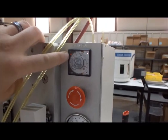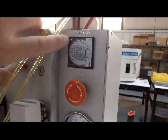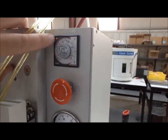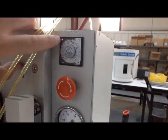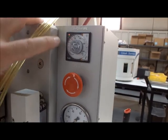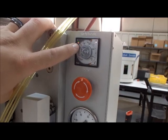Right now, this down arrow button means that it has not reached the set point. The little round one says it has, and the up arrow means that it's overshot the temperature — don't be concerned about that. It only overshoots by about 5 or 6 degrees centigrade, and then it cools back to the set point. You can see this is all set by the dial — right now it's set to 60 degrees.